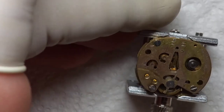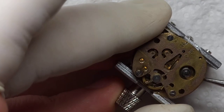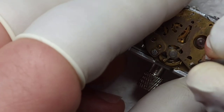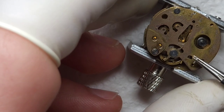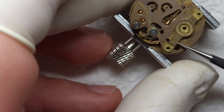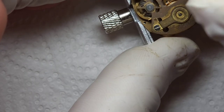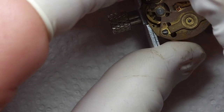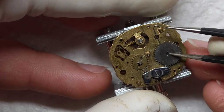As I said before, there was a mild issue when I put that hairspring back in - I actually put it in far too far, so I struggled to get it to start running at first. I don't know if I show that here or a little bit later, but it is remedied. Before we remedy that, let's just get the rest of the watch put back together. Now it's just that final bridge for the mainspring - we line those up, drop the screws back in, and good to go. There really is nothing to this watch. Very simple, very low amplitude - but it's nice, a refreshing change.